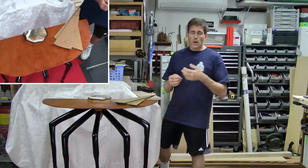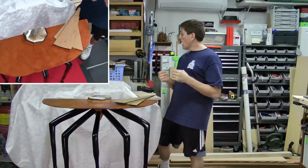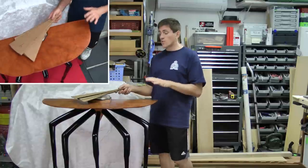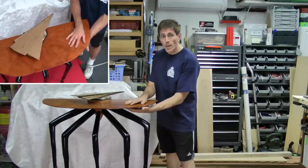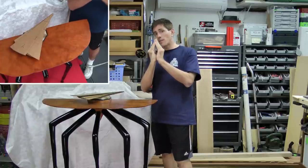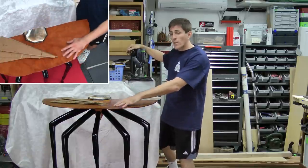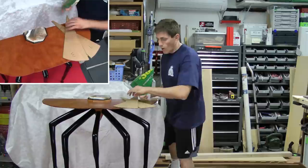Normally when doing a panel you're going parallel to the grain and the track saw cut is perfectly clean. Even in this case you probably could glue up the wedges and be fine. But I wanted to make sure those edges were really clean before glue-up because they could look fantastic at first and then when I start shaping with the sander I might reveal a gap in the middle where the joined surfaces were bowed. Each one of these scallops follows the wedge, and I mostly went down the center of a wedge for each part I scooped out with the router.